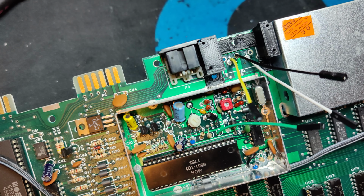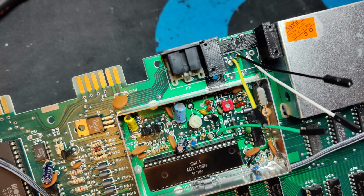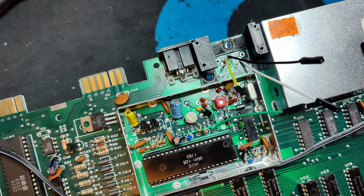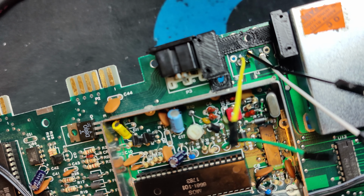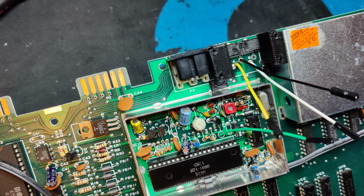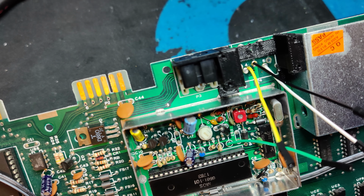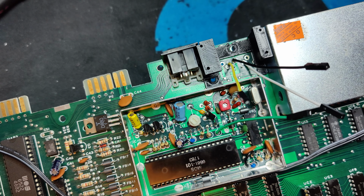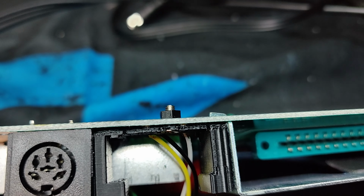We now solder the cables that will go to the new PCB. 2 is ground, 3 is audio, 4 is the luma signal. And from FB7 we will get the chroma signal. If you don't have a ferrite bead on FB7, just try to tap into the signal coming from pin 2 on the VIC chip, as close to pin 2 as possible.